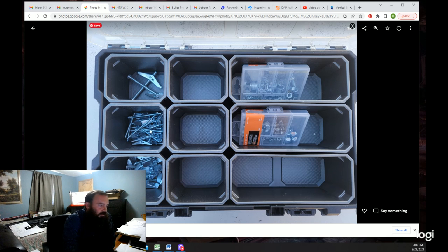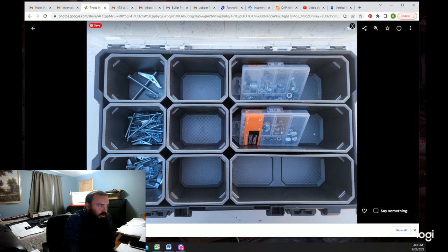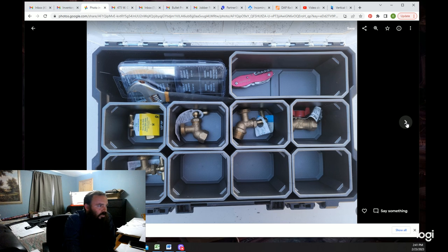I love this kit. These toggle bolts are what you use for toilet paper holders and towel racks in the bathroom where the sheetrock keeps pulling out because those holes just keep widening. You pinch the toggle shut, push it in, and then it flips back open and pulls up against the sheetrock from behind.